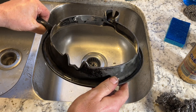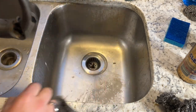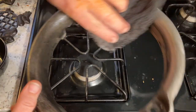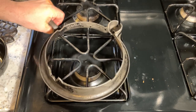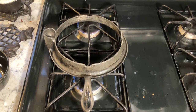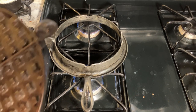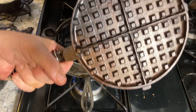So let's dry it off and grease it. It doesn't have to be bone dry, just dry enough to allow us to spread on a layer of grease — a little bit of Crisco. Then we put it under a very low heat, not to season it, but to dry it off and evaporate any water that is still on the metal. It seems like it took about nine hours in the e-tank to get the base done, which means I'm going to do this first paddle overnight.